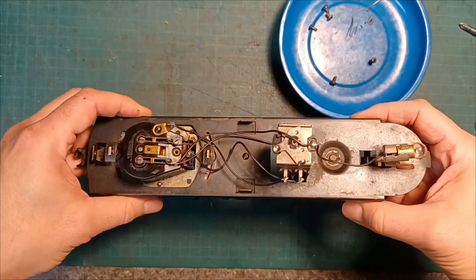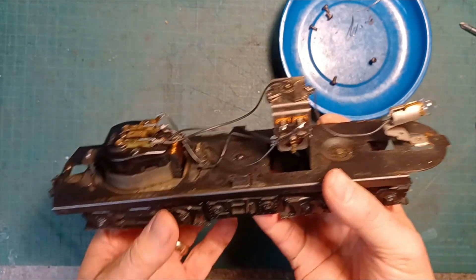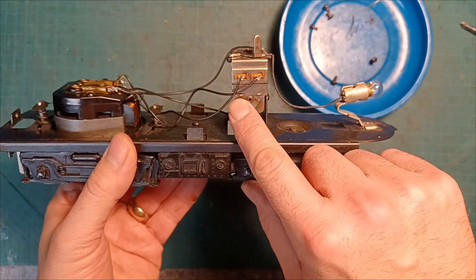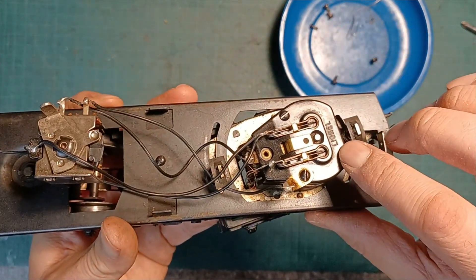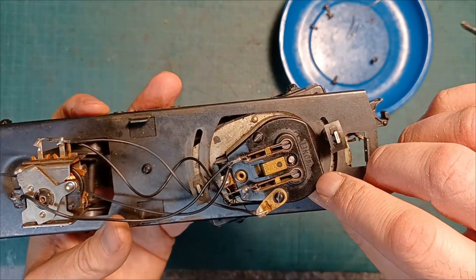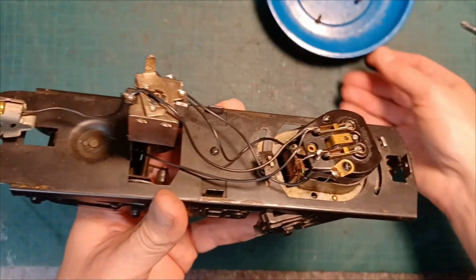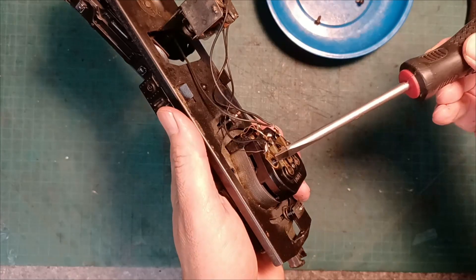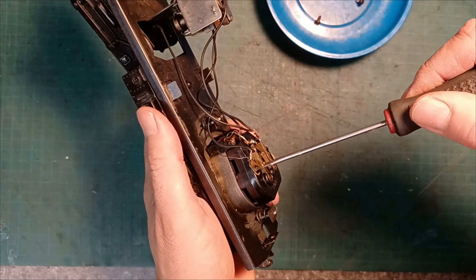We're going to have a look at the insides here. Obviously there's the motor, and there is a directional control, but this isn't like an E unit like the regular trains you've been seeing on here. The first thing I'm going to do right off the bat is take the top off, have a look at the commutator and the armature, make sure that's all clean and free of dirt, and then we will start investigating the rest of the locomotive. Let's get a smaller slot screwdriver so it'll actually fit in the screw.